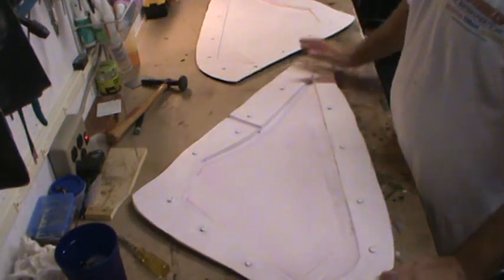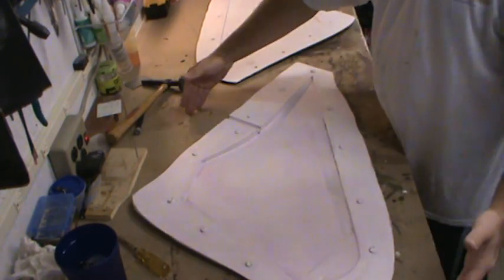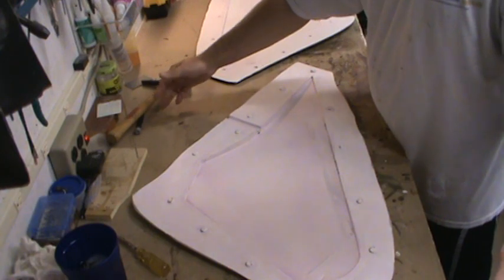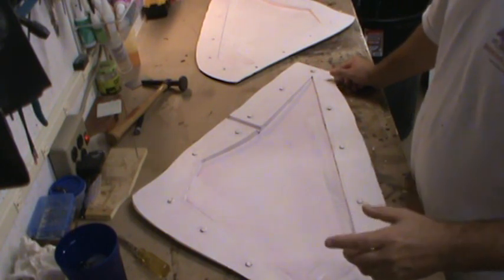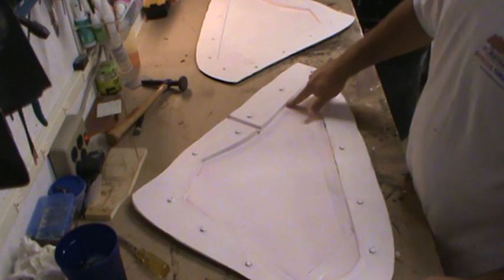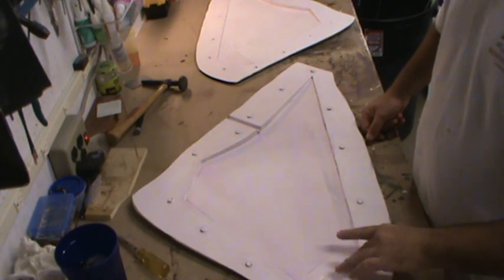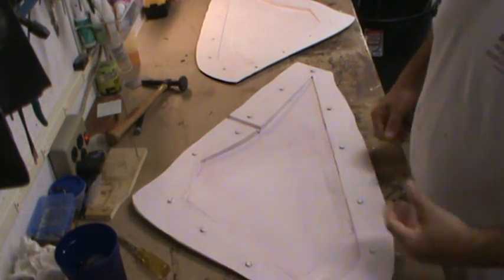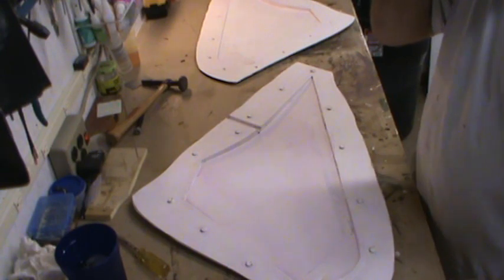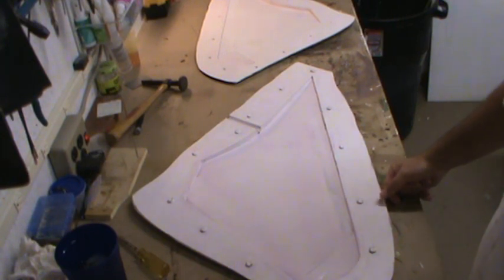You're probably wondering what I'm doing with the cutoffs — the fiberglass cutoff pieces are a good eight to ten inches larger than the flanges. I've saved all of that stuff, even the little thin strips, because when you get ready to do corners inside the actual parts and molds you can reuse that material that doesn't have resin on it. I've got a pile of this stuff in different weights. You won't know the fiber orientation, but since it's being used for corners or lower-priority applications like the windscreen and canopy plug molds, you can use it there — so you're not wasting it by throwing it away.